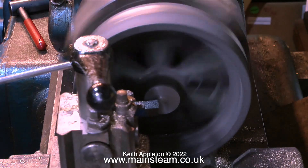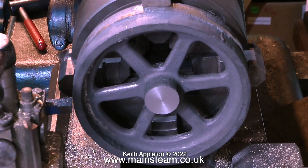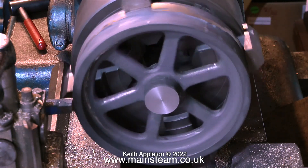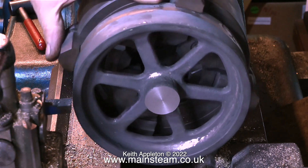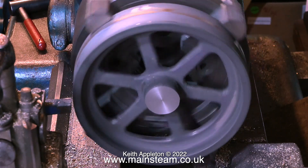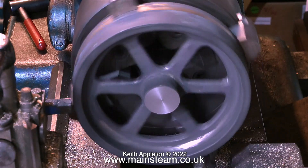If you're watching this clip closely, you'll notice the lathe tool was near the edge of the flywheel before I started turning it. I'm double-checking by positioning the tool close but not touching the flywheel — this tells me whether it's centred and gives a good reference point. Now I'm getting somewhere; this is running quite true, so I think I'm okay to start the cutting procedure.